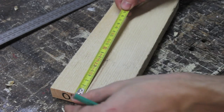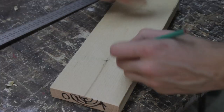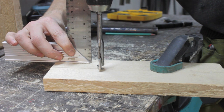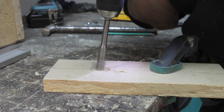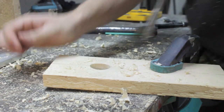On a typical birdhouse of this height, the center of the entrance should be approximately 8 centimeters from the top of the front wall. If you want to, you can drill the entrance at a slight upward angle. This will minimize the chance of water getting in. This is just another tip for making the construction a little bit safer for the inhabitants.